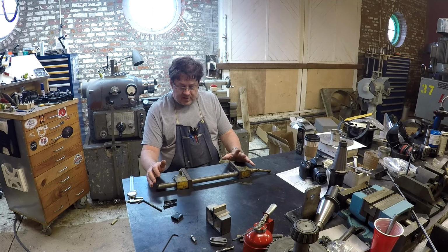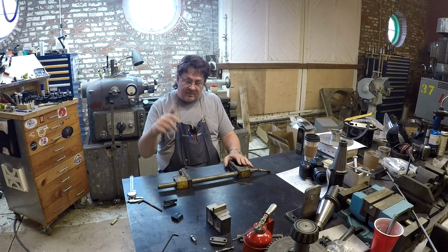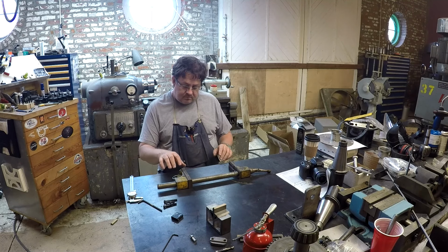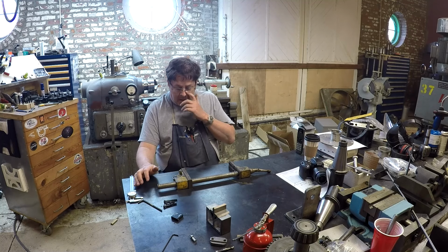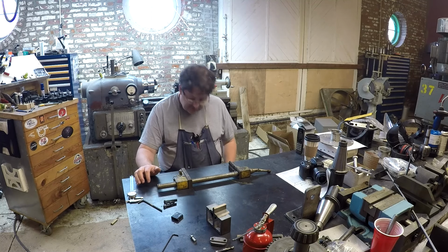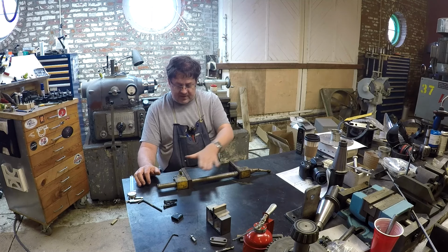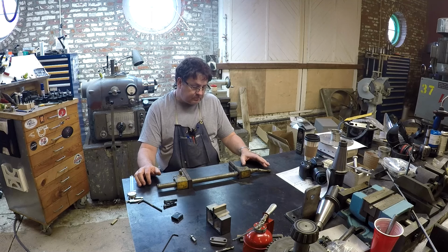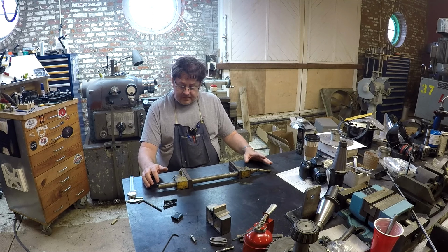What we are going to change here is the jaw inserts. There are two jaw inserts in here. Again, I'm going to bring the camera around in a second. The jaw inserts are just drilled all up and beat all up, and in some cases band sawed, so they're pretty banged up. So we're going to make two new jaw inserts for this. We're going to overall just give it a little cleaning and get it looking in a little better shape.